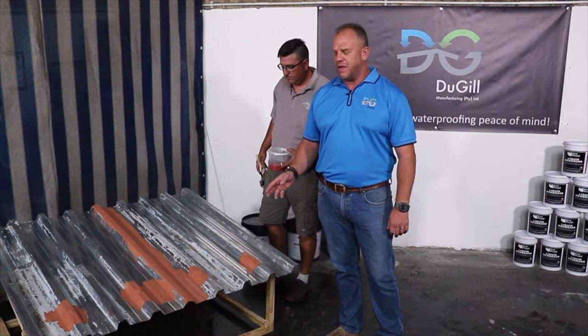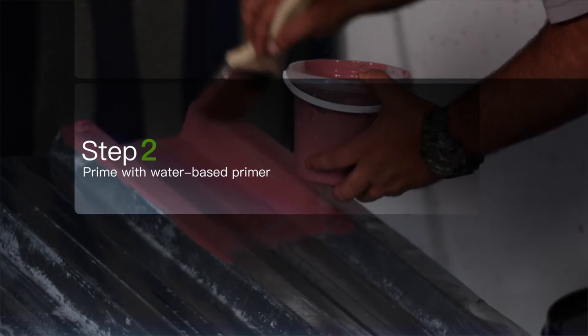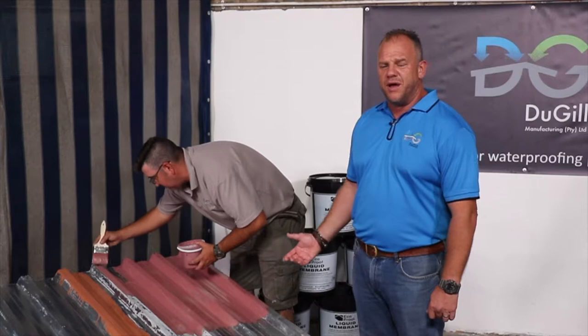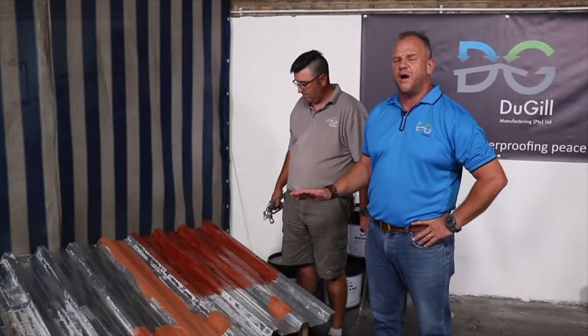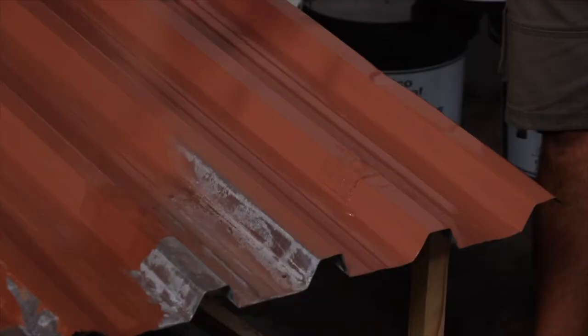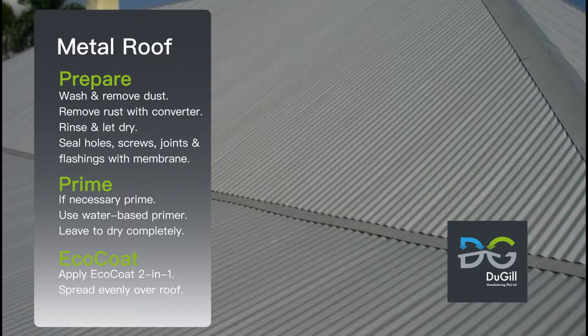When you finish preparing the roof on all the lap joints, cross joints and your roof screws using our EcoCoat product — the EcoCoat is a two-in-one, it's your waterproofing and it will be your final coat eventually. This roof has got no paint on it so we have to apply a primer on top of this. But if your roof has got old paint on top of it that you can't remove, you can just carry on with the final coat which is our EcoCoat two-in-one. When applying the primer you can apply it by brush, roller or airless spray machine. Make sure the primer stands for at least 24 hours — we don't want to put the EcoCoat on top of a wet surface. When you spray, always make sure you spray the grain of the roof. Don't go across because the product will cure and start making lines. Always go with the grain and make sure the product is evenly spread out.